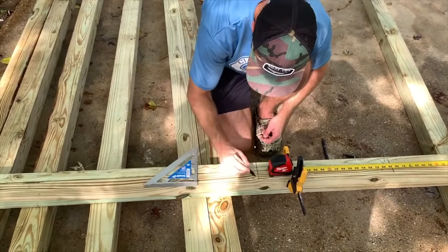A very important part of the shed build that I actually did not capture was you need to square your shed. And what this means is you're going to run a tape measure from both corners at the top of your shed to make sure that the distance is the same for both sets of opposite corners. Here's what I mean. So when you see right here, you want to make sure that your walls aren't skewed or slightly going to the left or right, because that means that your siding won't line up right. You'll have little errors all over the place.